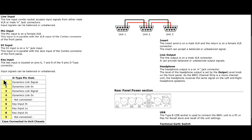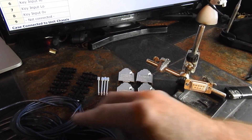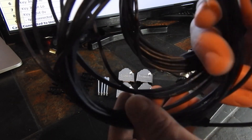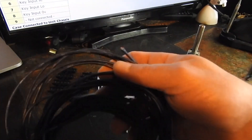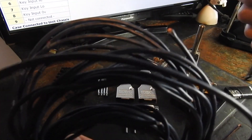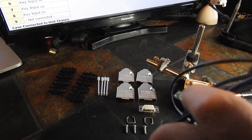I'm going to wire this to my patch bay — in for a penny, in for a pound, and just get everything wired up. I'll need two D-sub connectors to join the two units so that the compressor will be stereo linked. I've got everything I need: two nine-pin D-subs, the housings, and three wires — off-cuts from Van Damme multi-core. Really nice cable, and they have to be long enough so I can get each unit out of the rack without getting snagged. So I need a bit of excess.